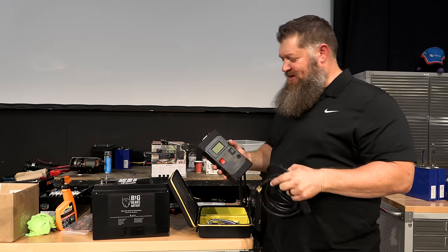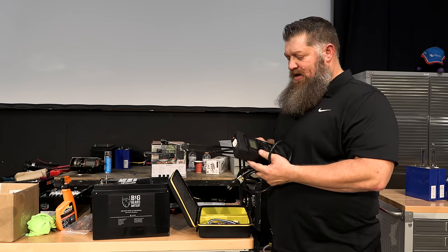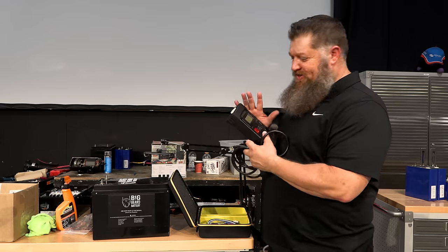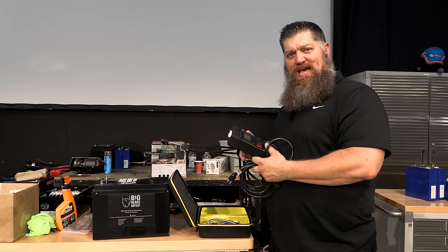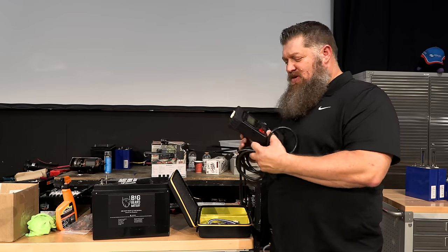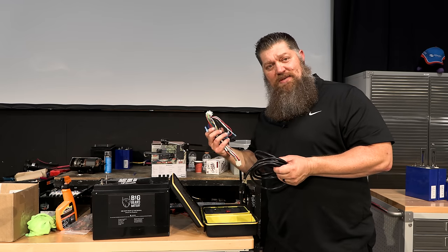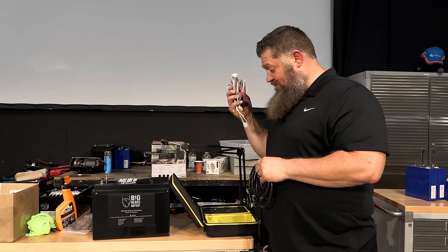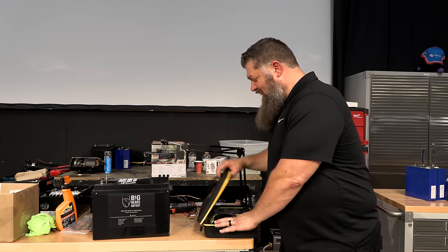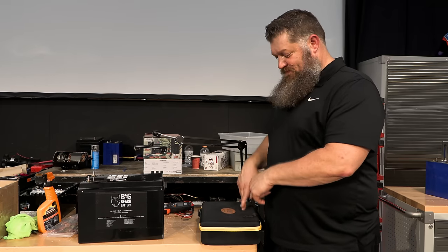You may have wondered what I was using to turn the air conditioner on and off — this is the Peacemaker by Skill Above RV Testers. If you're a technician called out to a site for air conditioning problems, typically you have to jump on the roof to find out what's going on. With the Peacemaker, you can diagnose whether it's a locked compressor or a fan issue from inside the RV without getting on the roof. It works with pretty much all brands of air conditioners by swapping harnesses. Want to find out more? Go to rvtesters.com.